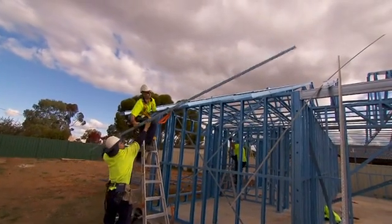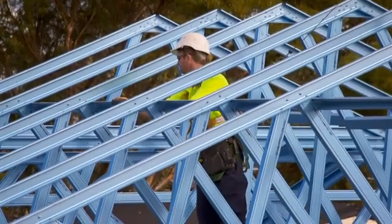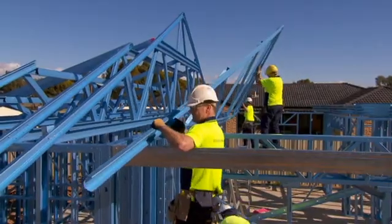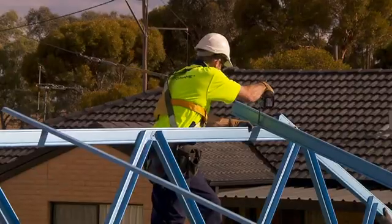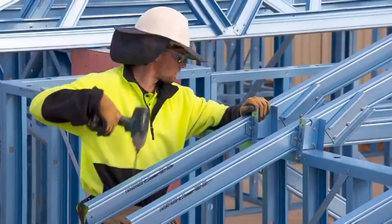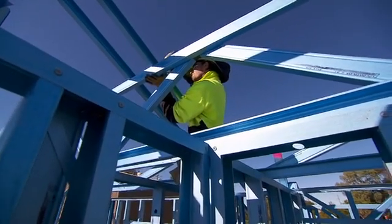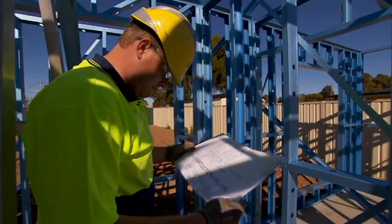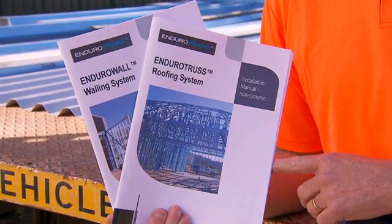Install the next two trusses and screw a piece of top span batten into the top cords of the trusses to temporarily brace them. Extend the top span batten out to catch and brace the next trusses. When all trusses are erected in their nominated locations, assemble the hip rafters as shown on the detail sheets, fixing through the top cord of the trusses into the hip rafter. Mark the overhang length on the jack rafters using the truss overhang as a guide. Position the rafter with the branding at the outside face of the wall and square to the wall. Fix the jack rafters to the top plate and truncated truss top cords in accordance with the connection drawings. Install the bracket between the hip rafter and the jack rafter, and install bracing over the top cord of the trusses. Refer to the construction guide for the connection drawings and screw specifications.